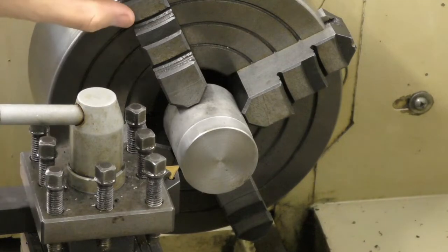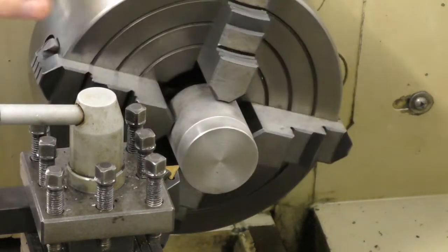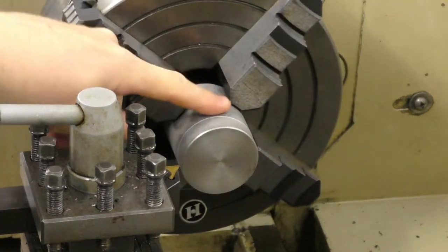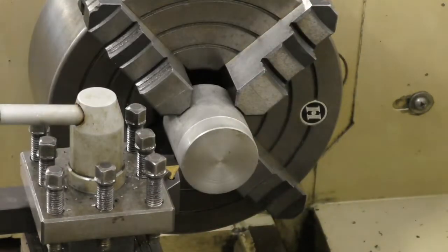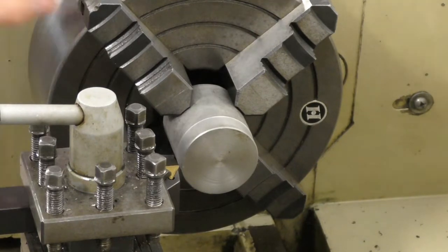I got the smallest piece in the four-jaw, dialed up. I sandblasted them all quickly just to get all the rust off so the rust dust doesn't go all over the lathe and make a mess - makes it nice and easy to clean up later.